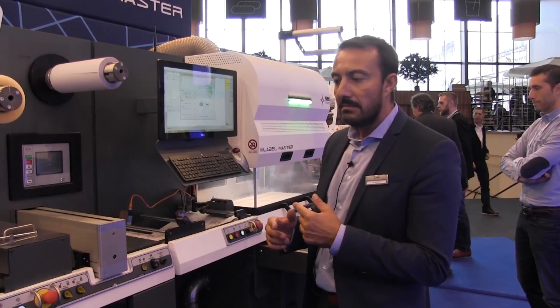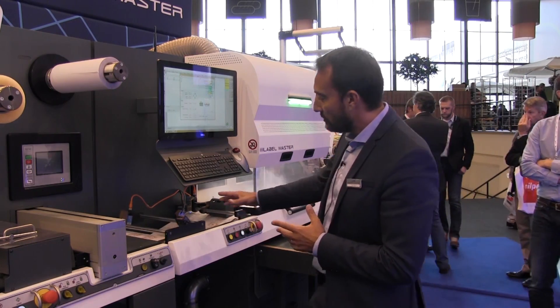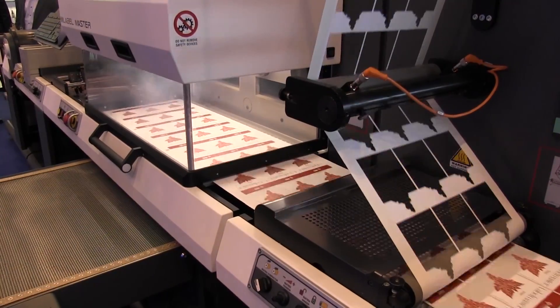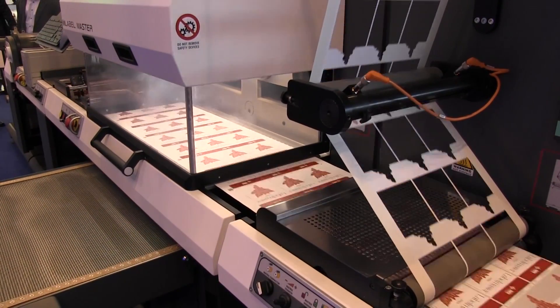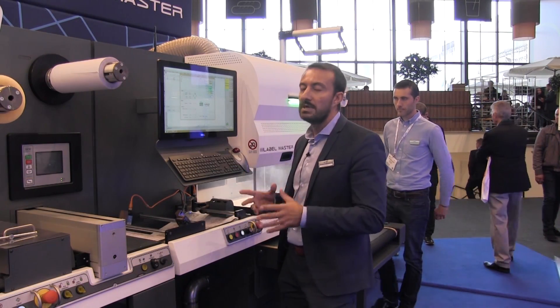We have many different jobs in the same roll. The barcode reader, reading the QR on the barcode or variable, can change the shape but also the parameters of the laser, and the quantities needed can always be under control with no operator error.